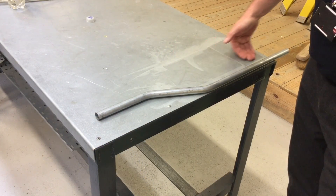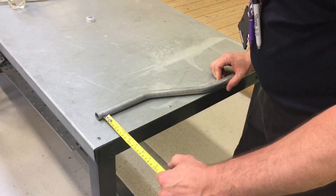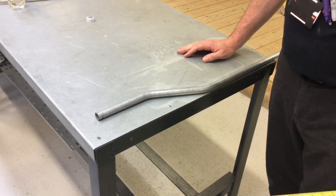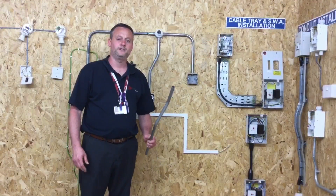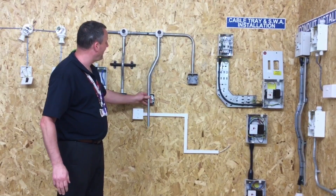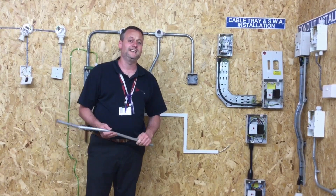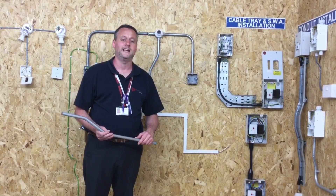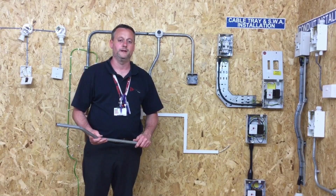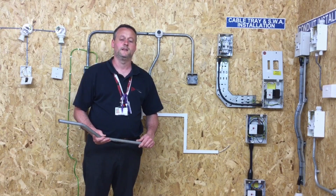By putting a little more bend in the second bend, we've now got the two surfaces running horizontal, and when I measure here I've got approximately 75mm between that gap — which is what we're trying to get. We're approximately at 75mm using a technique with just two straight rules to work out where to pull the second bend. We've managed to put our double set in the conduit and get it close to the 75mm dimension required by the assessment. Placing it against the template on the wall, we can see we're fairly close to the required dimensions. I'm not suggesting this technique is easy, but it's one worth bearing in mind when you're training. Often people on site will pick up a piece of conduit, put the bends in and it will fit perfectly — you cannot teach that experience — so I've come up with this ruler method to give you some chance of developing a set at a certain dimension.